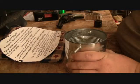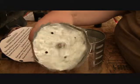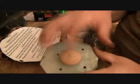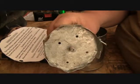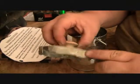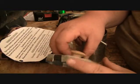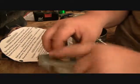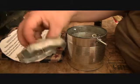The top of it, I made out of a piece of galvanized sheet metal that I had. This knob was a cabinet knob. I'm a little bit of a woodworker and I had that left over. And I used a brake line nut, a double flared nut, to space that out because the screw was pretty long. I just traced the outline of this can on a piece of metal, went out about 1/2 inch to 3/4 inch, made marks, and cut it with a pair of tin snips. Drilled some holes in there to let steam out so it wouldn't boil over.